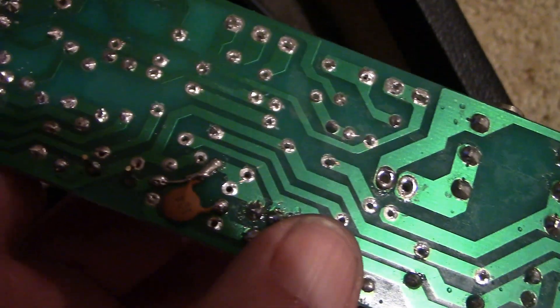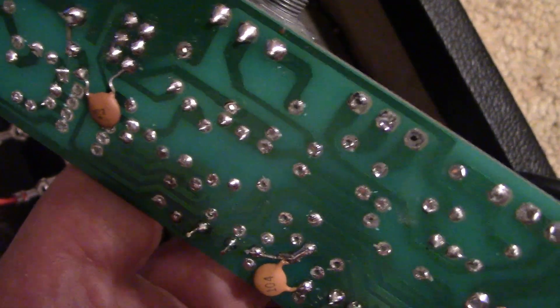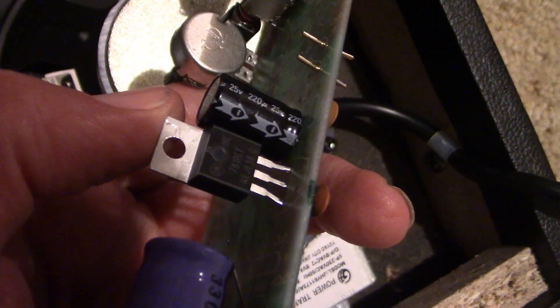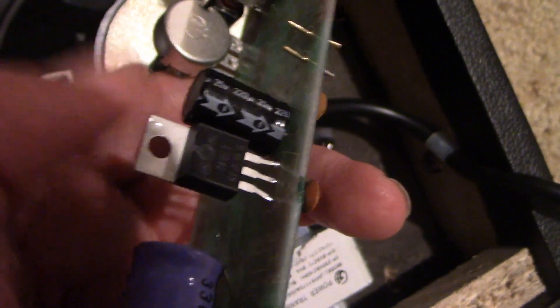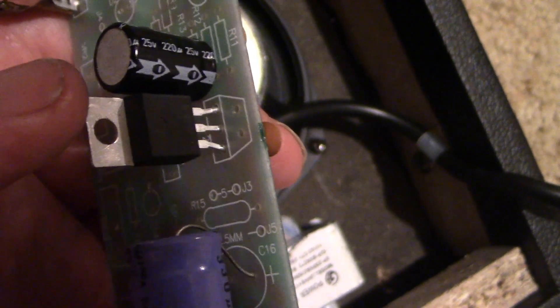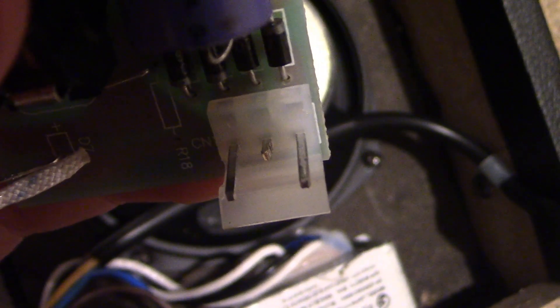The underside of the board is a bit untidy — there are a few parts there because the track layout didn't quite suit putting them on the top side. The main new addition is a 7812 voltage regulator, which makes this a regulated supply instead of the unregulated one before. I've also added some bigger electrolytic capacitors. I've also cut one connection from the power transformer, slightly modifying the power supply circuit. Previously it gave plus and minus voltages for the op-amp audio preamp, which I've removed.